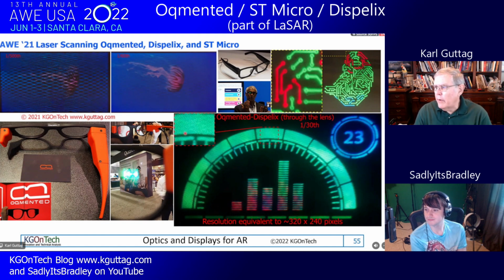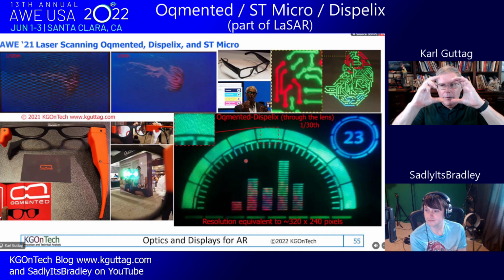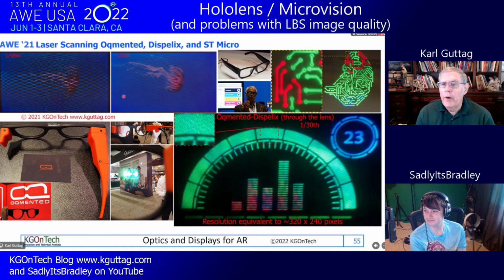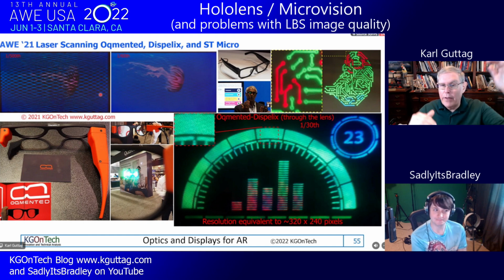This also is showing that Augmented, you can kind of see the grid that's in there. And remember, you're trying to translate this rectangular image, with square pixels effectively, onto this really weird grid, and say turn the laser on and off on this thing. It's a hard problem. So you just munch the problem around, and I think you create a problem that is pretty much insoluble. The worst problem I have, though, when you net it all out, I have a thing on my blog, I've done this before. If you do the 4th grade math, when I first heard HoloLens 2 was using lasers, the first thing I heard is they were using 50 kilohertz for the horizontal mirror. 50 kilohertz may sound fast, but you've got to realize old-fashioned television was interlaced, which is really only 30 hertz refresh, or half the number of lines at 30 hertz.